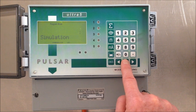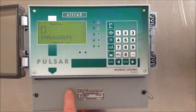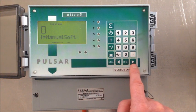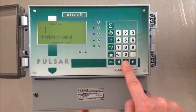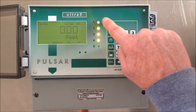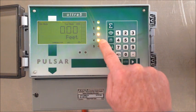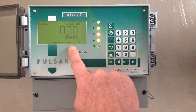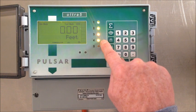We're going to go to simulation and we want to select manual soft, which means the relays won't kick over, but the arrow keys on the manual portion will take the level up and down. So we want to select one — manual soft. Now it's currently showing relay one is green, and the other three relays are orange, and then this final one is off. What it's saying is relay one is energized, which is the off point that is energized. Relay two and three are the on points for the pump but they've not come on, and we don't have a high alarm yet.